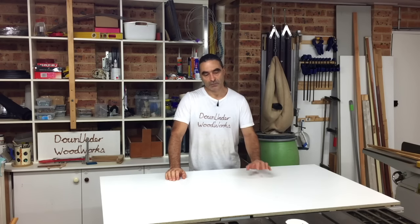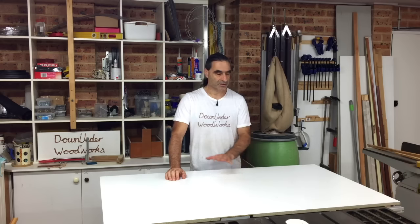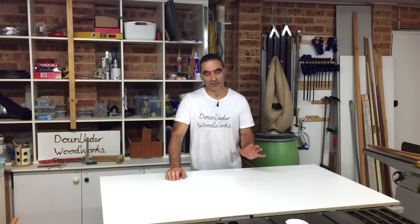I just quickly wanted to go over the reasons why I chose melamine for the top of the outfeed table. First of all, it's very easily available and fairly inexpensive. The other reason is that it's a very stable and flat material. The melamine itself is really hard wearing, and it's also quite slippery, so that'll help with it being an outfeed table. I could have used MDF, but I would have had to clear coat that, and that may have needed reapplying, so I didn't really want to do that.